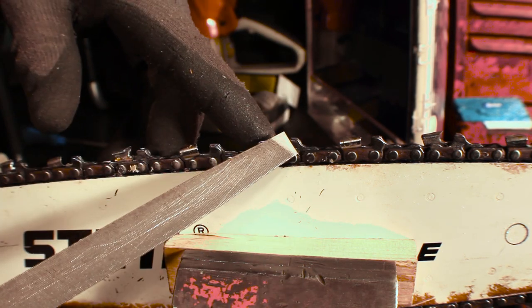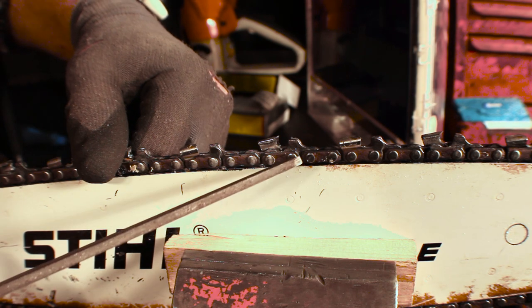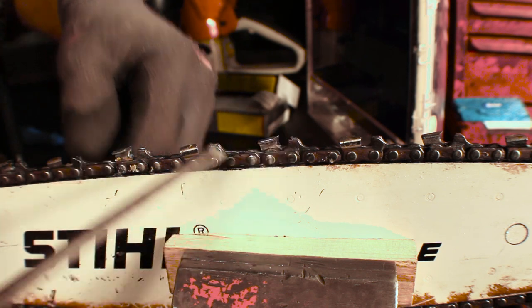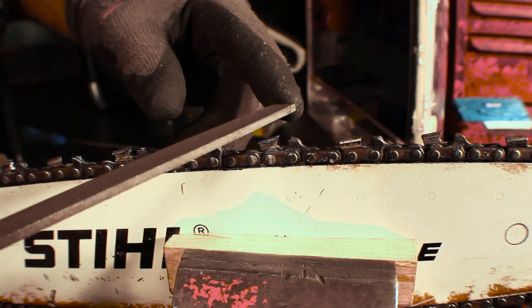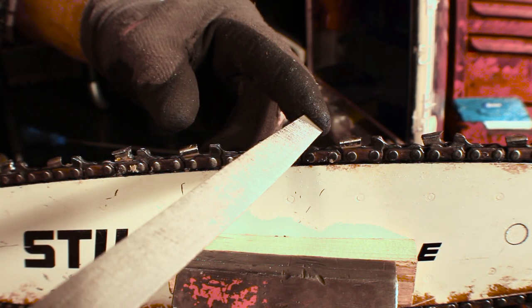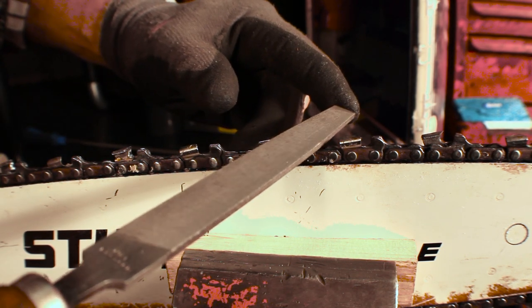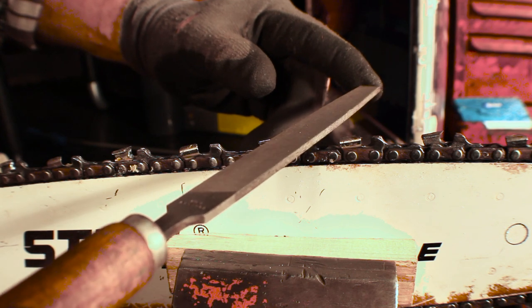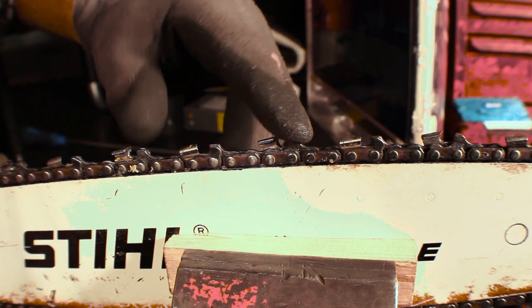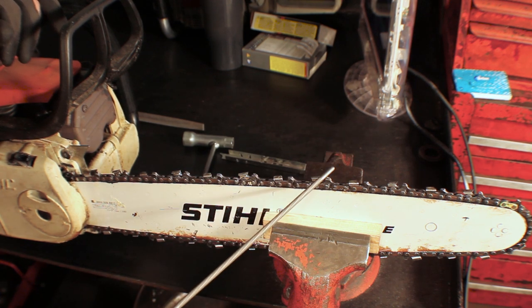In addition, because you're filing flat, these depth gauges will also need to be rounded occasionally — not too often. If you just have a sharp angle where the depth gauge hits the wood, you'll get a lot of vibration. So you've got to round the tops every once in a while. Whereas normally you're just filing flat across, to round them you kind of turn your file at an angle, run a filing pass across, at the same time gradually decreasing that angle until you end up flat. That gives you a nice rounded profile so it's not vibrating and chattering in your hands.